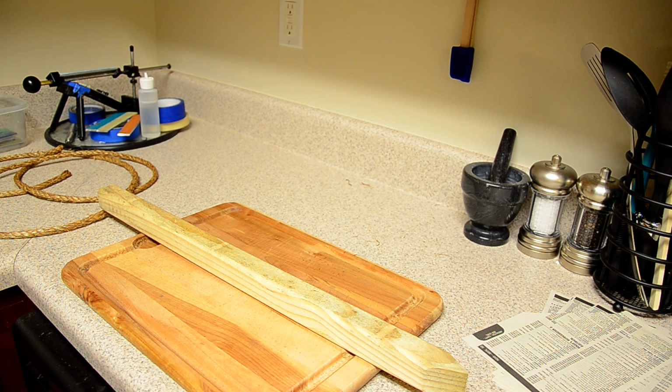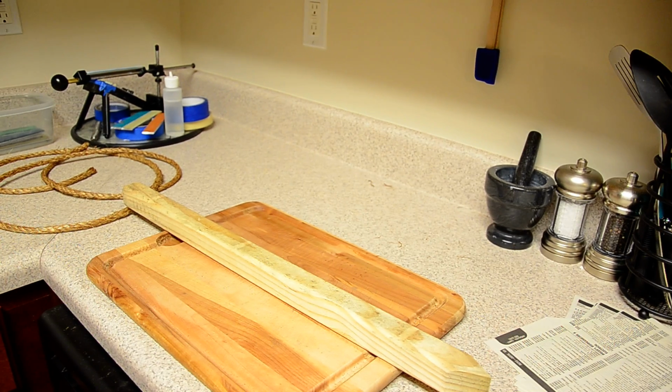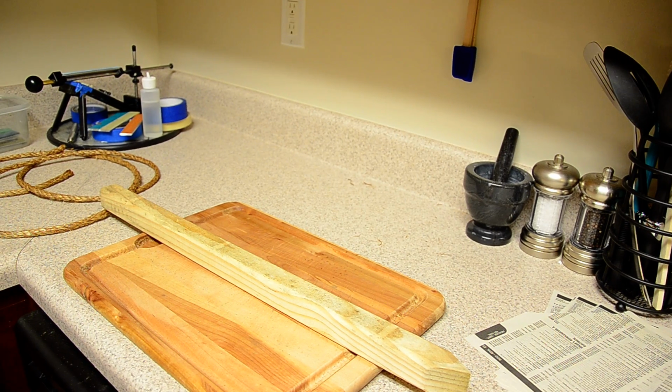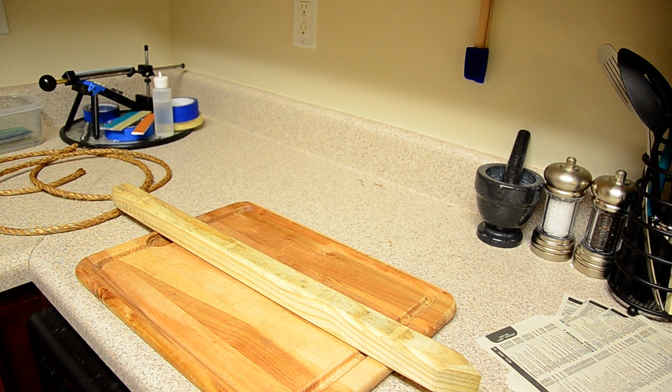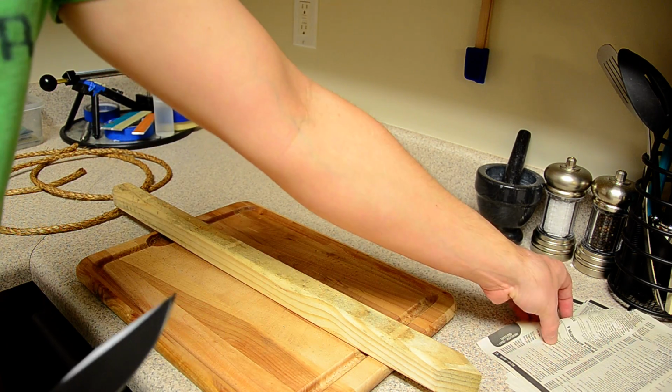the actual bevel was polished. I did that on purpose just to give my friend Alex a nice looking knife. What I did was I sharpened it on the Edge Pro and took it to 10,000 grit, and then I went and took my brown Spyderco profile rods and laid sort of a pseudo micro bevel on it. So the edge has some tooth for sure. I mean, it has some tooth, but it's still like wicked sharp.